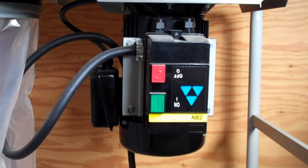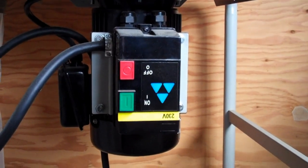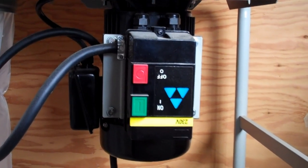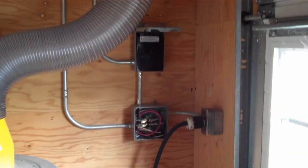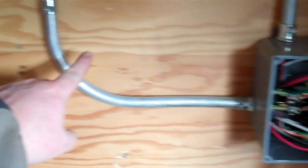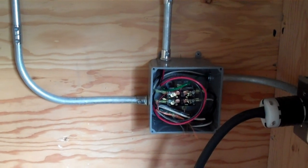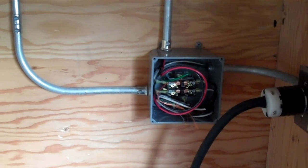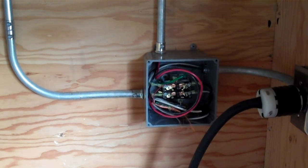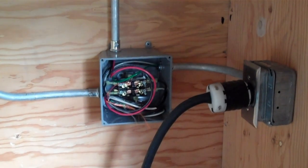I had the electrician work on this — he took the cover off and basically bypassed the on and off switch, so this on/off switch is no longer working. However, he kept the thermal overload protection relay wired in so that we still have that protection. So now this dust collector is solely controlled from upstairs in the shop — no longer controlled down here. This conduit here runs up to the shop and that's all the low-voltage wiring. It goes through a series of three- and four-way switches, over near the main electrical panel where the 24-volt transformer is set up, and continues the loop back down here.